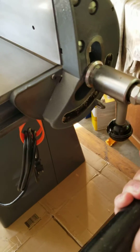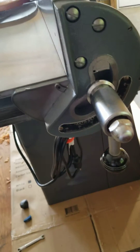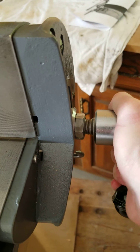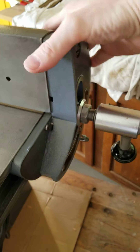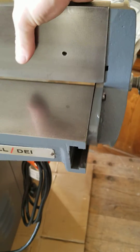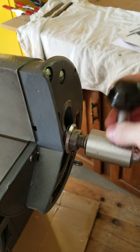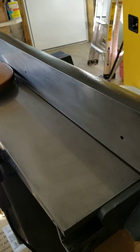Get this handle out of the way. The way it works is you pull out around this nut and you can loosen the table and unlock it. That allows you to slide the fence forward or backwards very easily. Once you have it in position, you just lock that down into place. So that sets the position of your fence.